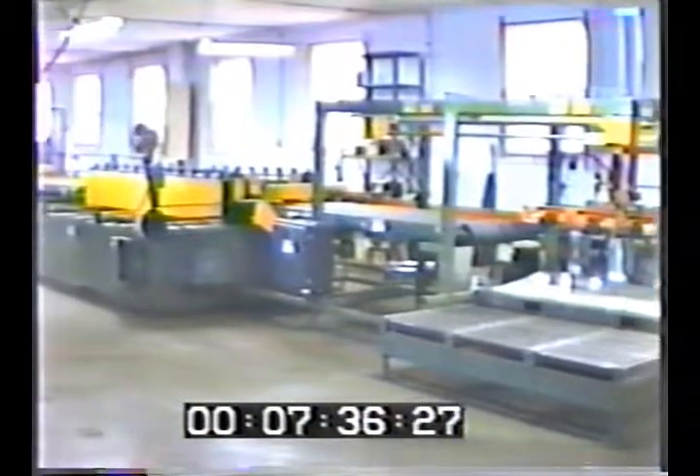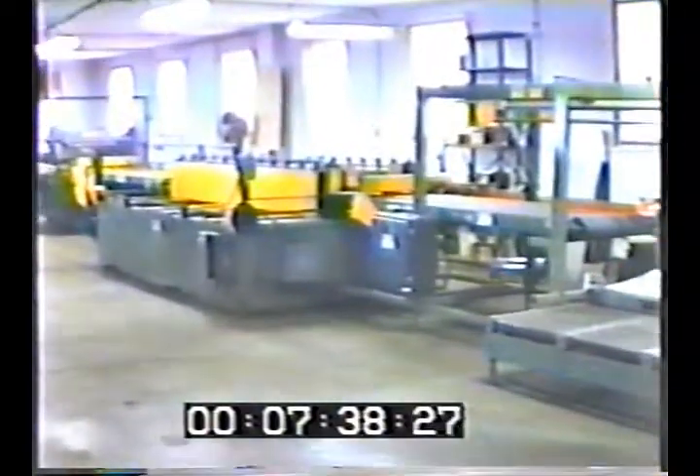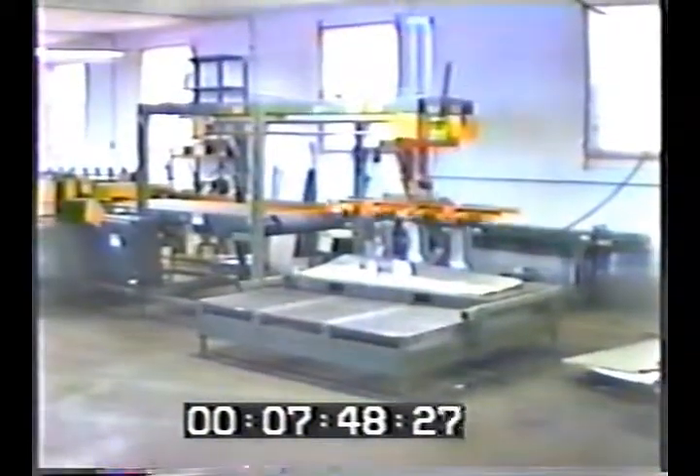The next system was designed and manufactured to form a three-sided plenum wrapper from pre-notched, pre-painted blanks. The system incorporated a D-stack and feed system, dual-head roll former, and a four-ram end-former wing-bender unit.